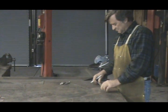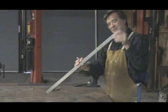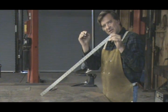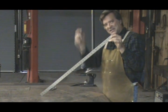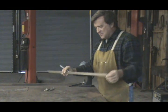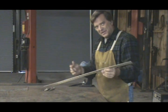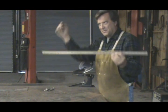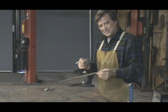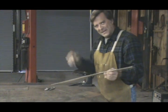Does the diagonal matter? No. It doesn't matter what diagonal you have on your piece of metal. It doesn't matter what numbers you use as long as you can go to the middle — half of ten is five, half of twenty is ten. It doesn't matter how wide it is. It speeds things up. You don't have to do high math, don't have to figure out what half of a thirty-second is and find that little tiny line. You can just work with the big lines, real quick, real easy. Back to work.